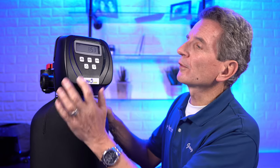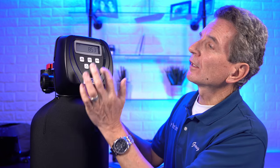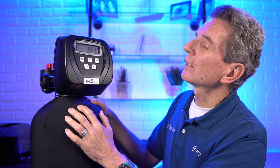If you're looking for a more in-depth manual, I've got them linked in the description. Now let's talk about what the different buttons do. Set clock — just like a clock radio: press set clock, the hours flash, use up or down, press set clock, the minutes flash, up or down, press set clock and you're done. Just be careful to check the AM and PM indicator in the top right-hand corner — it can be a little difficult to see. You can remove the faceplate to make it easier to read when setting the clock.